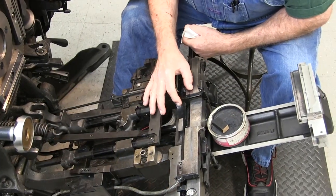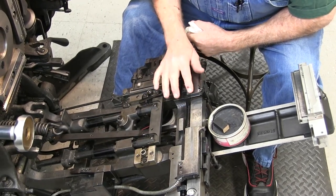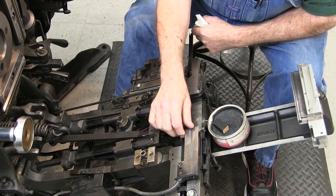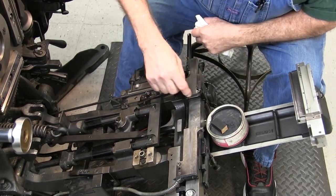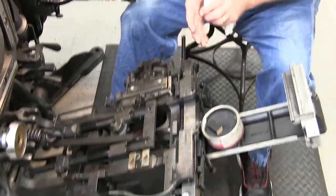What we're looking for is metal adhering to your vise jaws, wear in this area, and rounding of the jaws on both sides — particularly on the edge where the jaws physically hit the mats and push them together, because that's where you'll be getting hairlines if that happens.